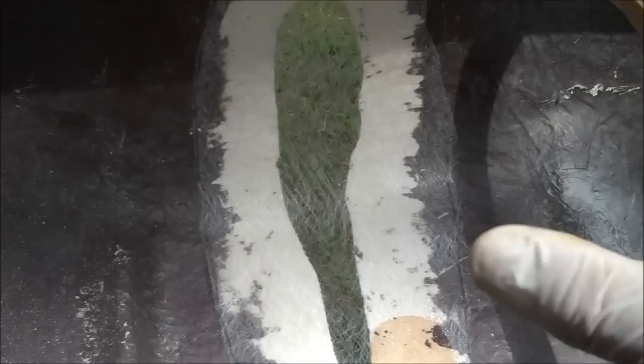I start out with a really thin fiberglass mat and when that hardens up it'll be the perfect platform to put on a thick cloth. When you're putting this on, try not to wipe as much as you're blotting — you just want to saturate the fiberglass. A lot of people will soak the mat first and then put it on, but I don't like to do that. It just makes a mess and you end up with too much resin. So I'm a blotter, not a soaker.